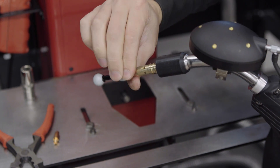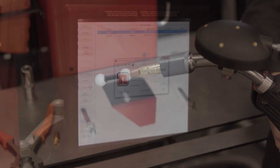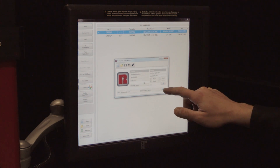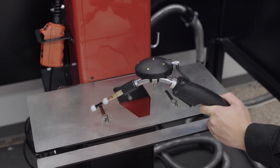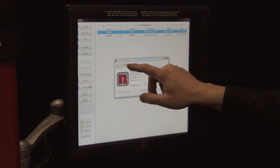Be sure to remove all tools and materials from the weld table. Press the gear icon located in the last calibration update column. Hold the gun within the field of view of the RealWeld cameras, making sure the gun is held as steady as possible during the calibration process. Press Start Calibration and hold the gun steady. Save the calibration by pressing the floppy disk icon and exit out of the edit screen.